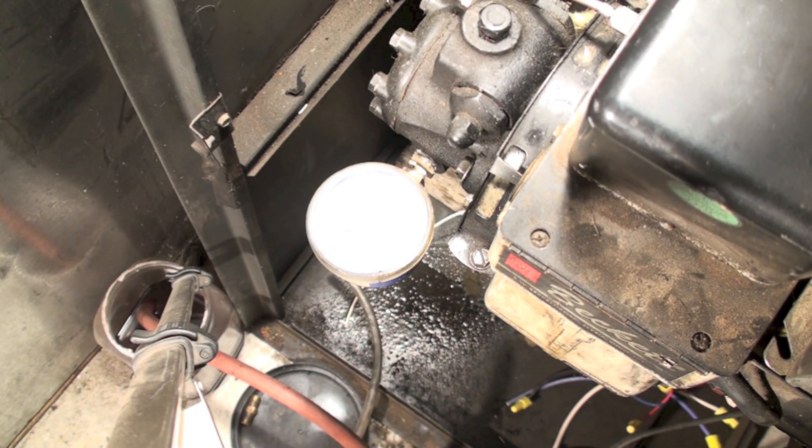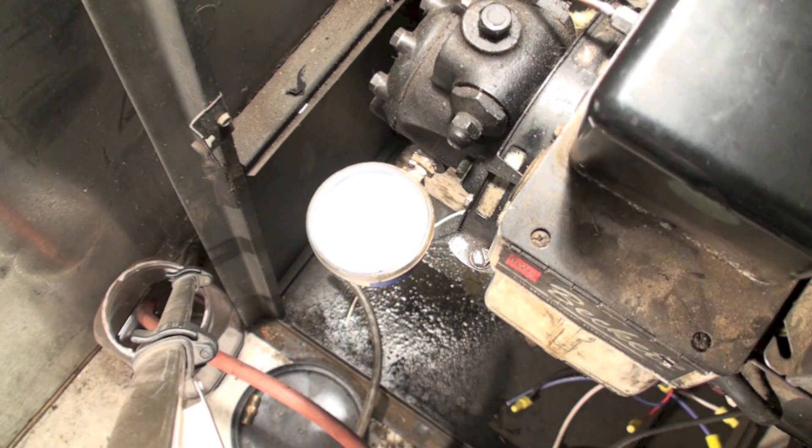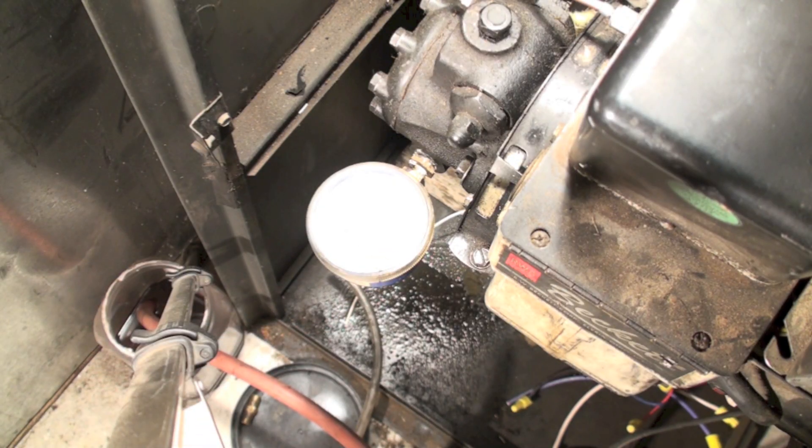Here I've got a close-up — I'll get closer yet — but I've mounted a pressure gauge for the supply line hooked up to the pump. If you buy a gauge like this, made for oil — this one's actually an old refrigeration gauge, but I sometimes use it for this because they're actually a pretty good gauge — this is going to tell me if the pump will pull any vacuum.